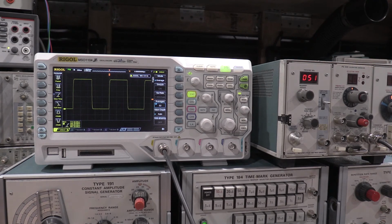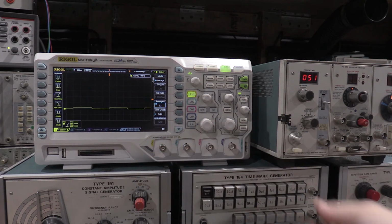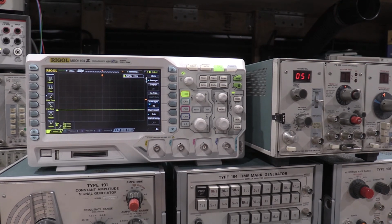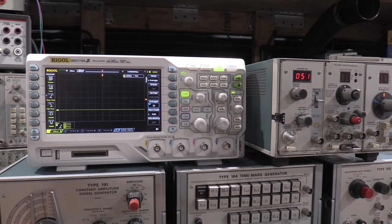In my lab, I have a GPS reference to do the frequency calibrations to get the gear set, and then go from there. We'll use the other leveled sine wave generator to do the frequency measurement, so I can show you guys the bandwidth limit. I was actually starting to think my scope was broken because it was reading very low. Get the right cable, 50 ohm terminator.